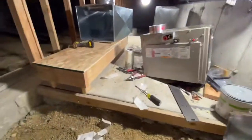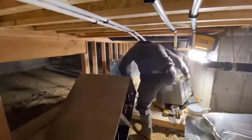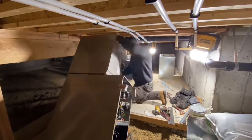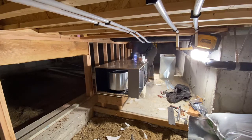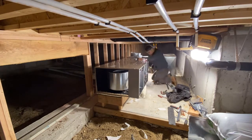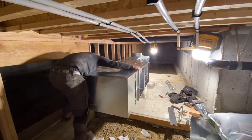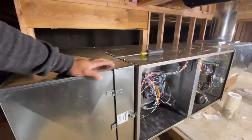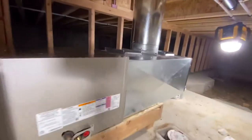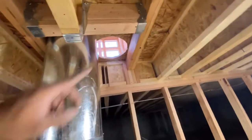It's my crawl space. It's my beautiful table I made for the furnace. So I got my furnace put together — here's my return air filter cabinet, and then here's the coil and then my plenum. This is a 12-inch going up to the attic. There's my return hole — it's just going to be flexed off that end, coming over and then up.